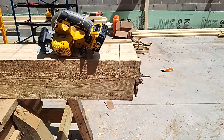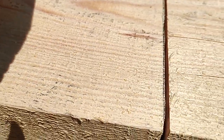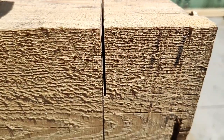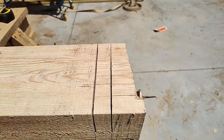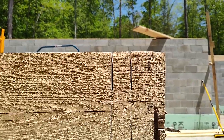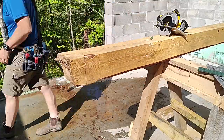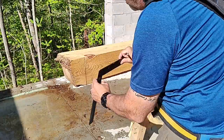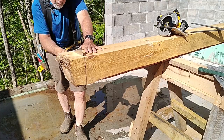I did notice when I was making my initial cut — really trying hard to stay on the line I'd marked on all four sides for a clean cut — that the bottom was drifting, so it looks like the saw was not in square. I made another practice cut lower down on the post, adjusted a set screw on the leveling cage of the portable saw, and now the saw line falls clean on my mark. That's important because I want a nice clean flat cut all the way down, since it's what will connect to the post base.